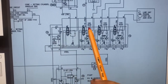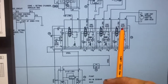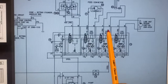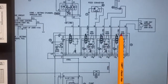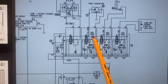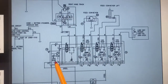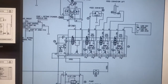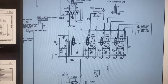It'll make sense in a minute when I put the gauge on. The other way to do it is at your A or B port — you have a fitting there so you can attach your pressure gauge directly and when you activate the spool you're getting the exact pressure going to that motor. That's fine; I prefer the test port method, I find it easier and less mucking around. But if you use the test port you have to be aware of standby pressure, which is 30 bar on this system.